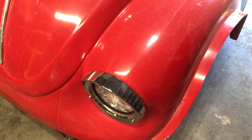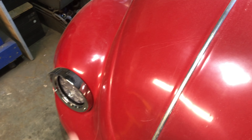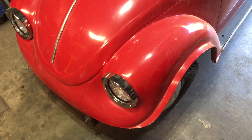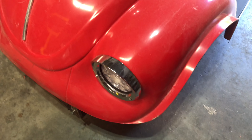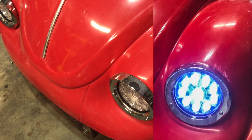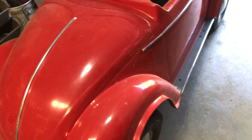There were a couple scratches - while we're on the subject - on this headlight and on the hood, and even some over on that headlight. I took Marvel Mystery Oil - just simple Marvel Mystery Oil - and put it down in the cracks. I'll try and put a picture here so you can see how bad it was before I put that on there, and that seemed to take care of it. So I'll probably just go over the whole thing, and anytime you see something like that we'll just put a little oil down into the gel coat and that should take care of it.